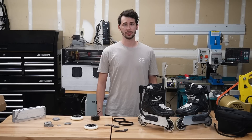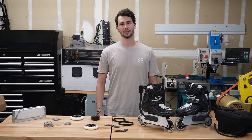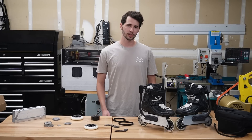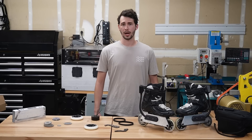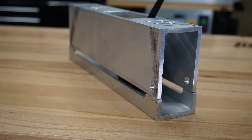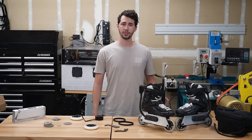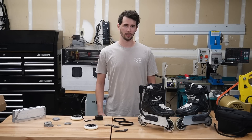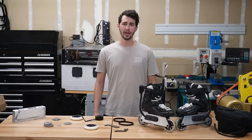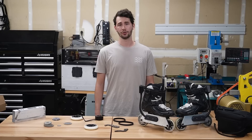Once I decided on a drive system, I moved on to selecting a motor and gear ratio. I wanted to keep everything as slim as possible because it would make the skates perform more like normal skates. Luckily, pancake motors — strong motors that are squished flat — are fairly common thanks to multi-rotors and drones. I managed to find these MAD Components M6 C12 motors, which had the perfect dimensions to fit inside some standard 2x4 inch aluminum tubing, which I could machine to make the frames of the rollerblades. This decision allowed me to do minimal machining and save a lot of money compared to machining out a big block of aluminum. I'm not sponsored by MAD Components, but these motors are pretty cool — they're compact, have specs and dimensions on their website, and I was able to order them with a custom 100kV rating for more torque.